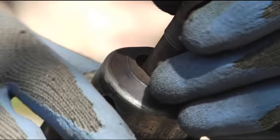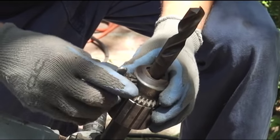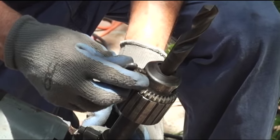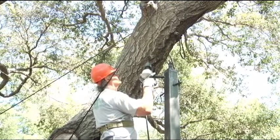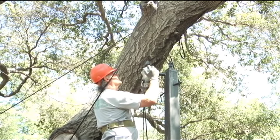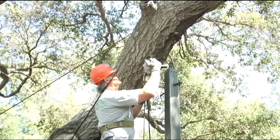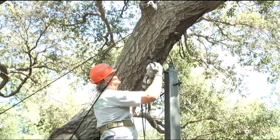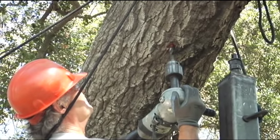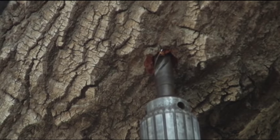Here's our drill. Our pin is 0.820 inches in diameter — just under an inch — and our drill is the same size. We're going to go on-size with our pin at our pick point. I'm going to have to do this little trick of angling in first and then straightening up, limited by our hardscape and brickwork.